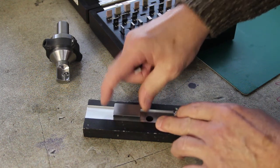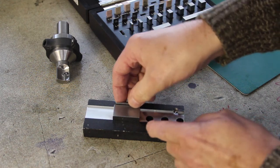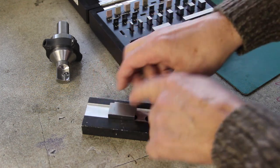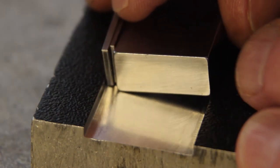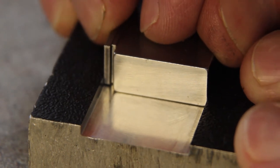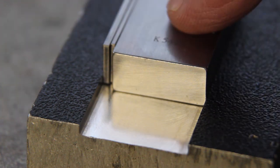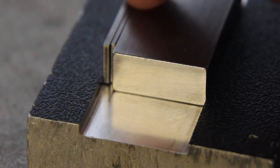There's a 20 mil gauge block plus 2 millimeters, and if I put the 2 millimeter block in as well, this still wobbles. So let me give you a close up and you'll see what I mean. This is the combination that I think fits it best. That's a snug fit. There's no play in that whatsoever, and that is 20 plus a 1 plus a 1.4,